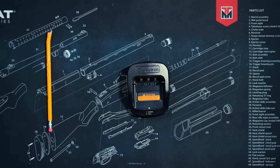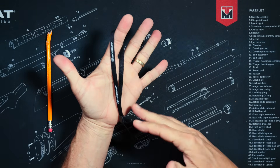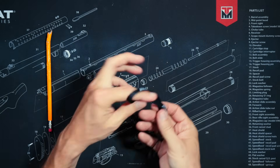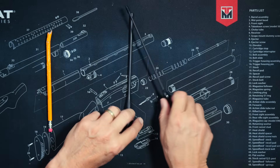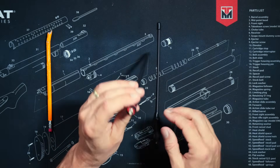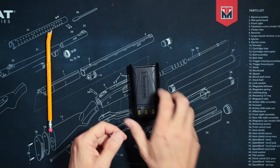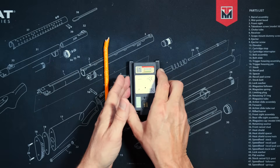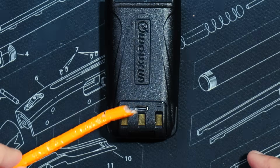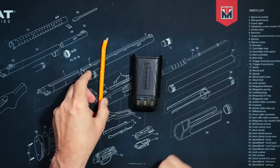You will receive a battery-charging cradle and power adapter brick. You will receive a very handsome, stylish, yet functional wrist strap. You will receive not one, but two antennas, both with standard SMA female-type connecting holes — one for the ham 2-meter and 70-centimeter frequency range, and the other for the ham 1.25-meter frequency range. You will receive a battery that holds 2,600 mAh, chargeable either by the charging cradle or via USB-C. The battery also has a charging status indicator LED, which many lesser radios lack.